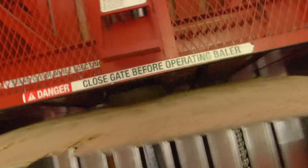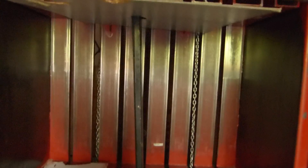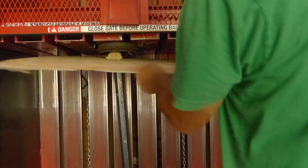Now you see we've got full puncture all the way through. So that's what it looks like from the underside. As you look at it — let's pull down this guy and reveal it. You see at the base of these columns it has the same indicators of puncture: the plywood, how it bent up, the deck reacting, similar to your column breaks. So this helps you understand the direction of the deck — which way it was coming off, along with the numbers.